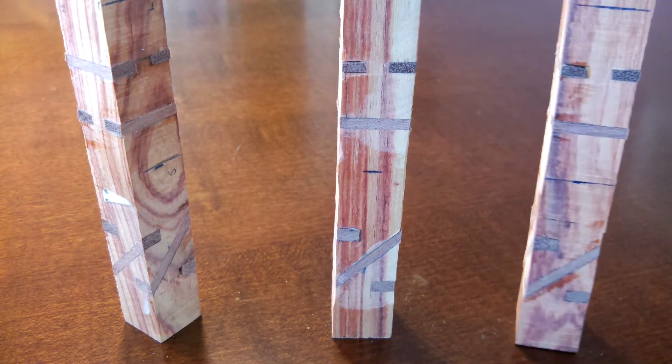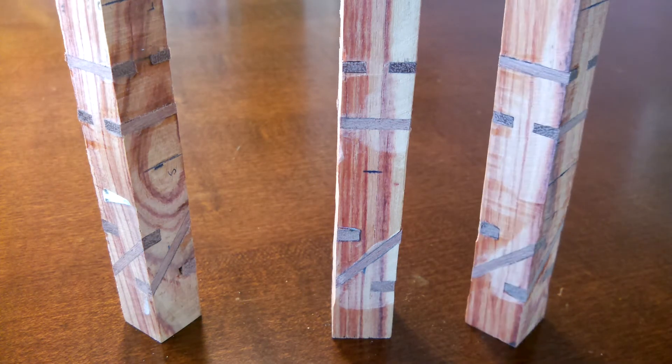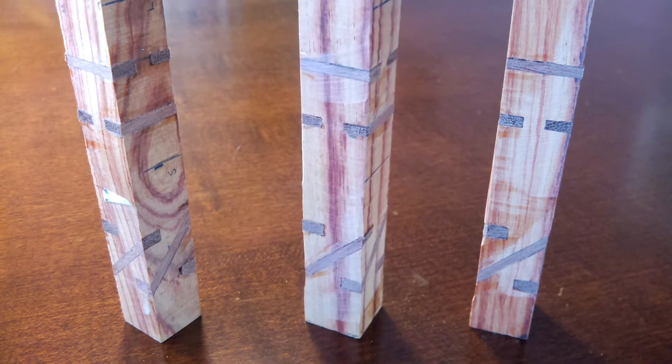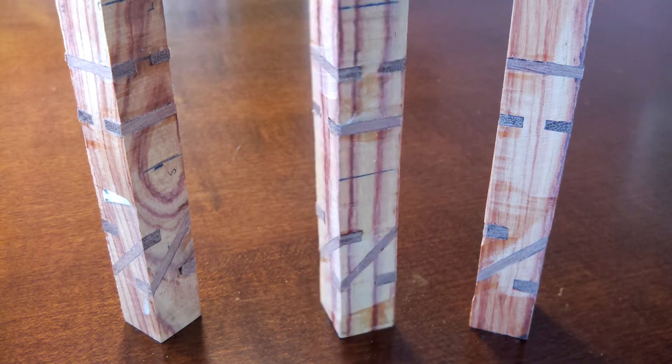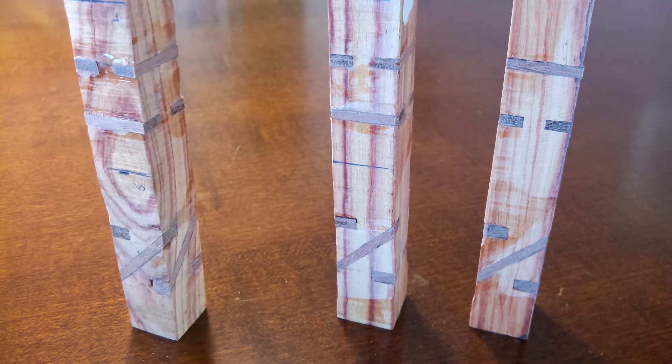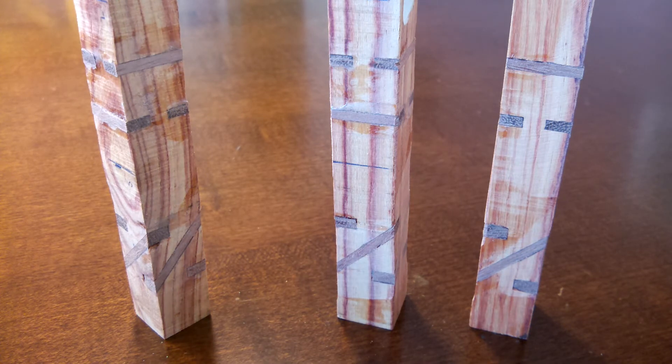Those cleaned up really nicely actually. It took me a few minutes to cut the tabs off, and then I just sanded them a bit to make them smooth so that the gouges on the lathe didn't catch any of the purple heart. Purple heart's a bit harder than the tulip wood, so I don't want to have a blowout on these ones. I'm going to be very careful about my lathe work.